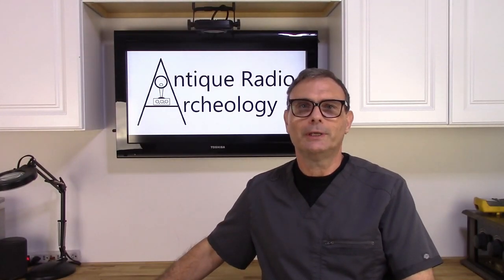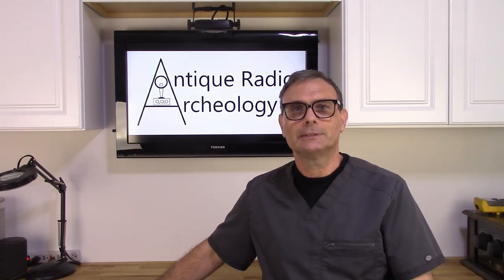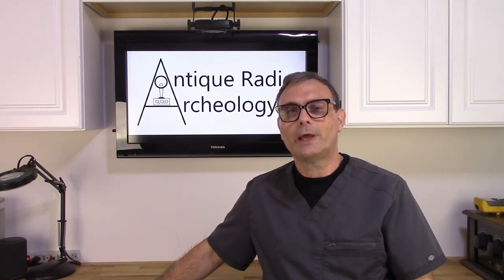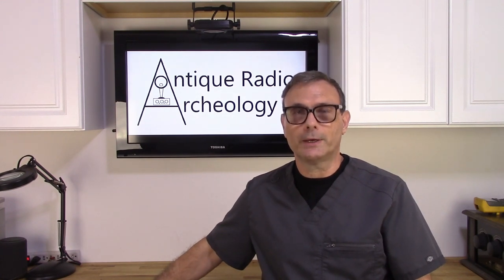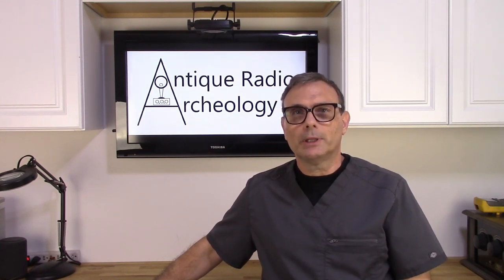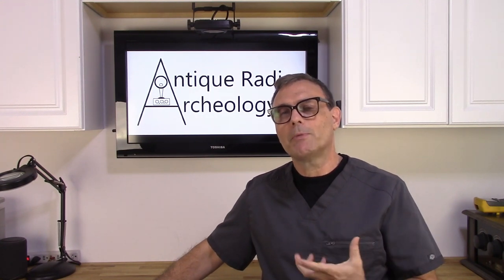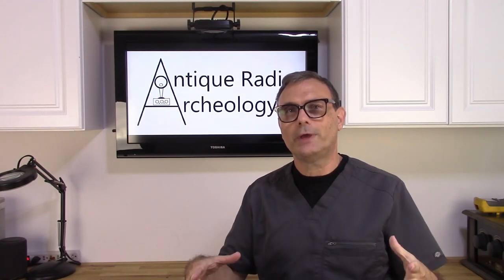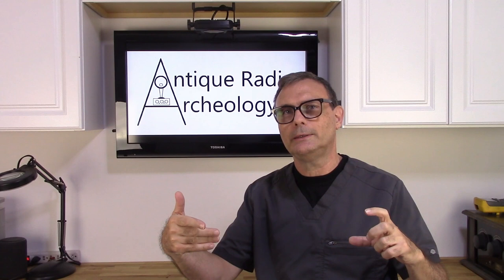So this concludes part one of the Westinghouse H204A series. We still need to replace all the capacitors that I've identified in this part. We need to actually look at the selenium rectifier, determine whether or not we need to replace it. If we do, we're going to put in a modern replacement, and I'll also explain why. We will also be looking at the power plug, which is attached to the back panel. We have to come up with a fix for that. And there's also the situation of cleaning up the radio chassis itself, and there's a felt background behind the radio dial that needs to be looked at, possibly replaced.